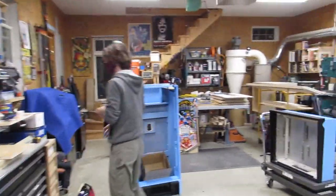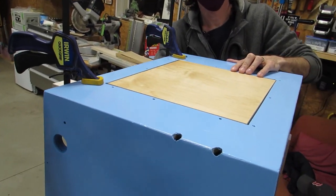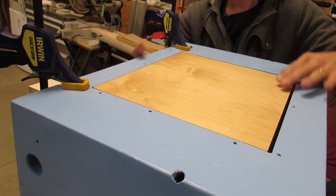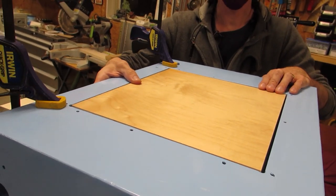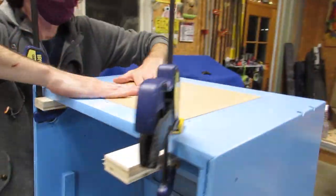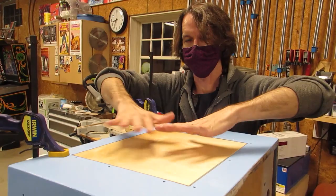The first thing we're going to do before we get started - because we're installing vinyl on the front of a pinball machine - when you install vinyl over the front where there's a giant hole, sometimes it's a little tricky because vinyl flexes and stuff like that. So we're coming up with a solution to make our lives easier. We're going to put a piece of scrap wood as backing to hold it in place temporarily so we can put our vinyl on and then take it off. We'll cut a piece of plywood that's a little smaller than the hole and temporarily screw some little cleats in to hold the plywood in place. When we do the decal, we'll put it over the whole surface, and once we're finished we can slice out the opening and pop this whole panel right back out. It's a lot easier than having your vinyl with this big floating blank space in the hole.